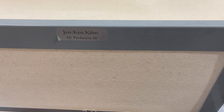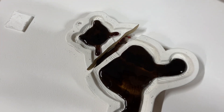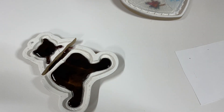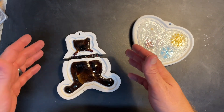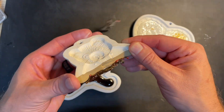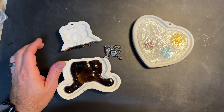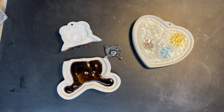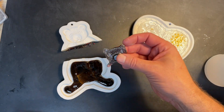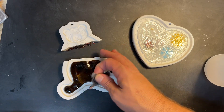These are finally cool enough and I have something to show you. I had peeked already so I knew what happened — looks like I had a break. It also looks like there's generally not enough glass in either one. Let me carry the pieces over to my workbench. I have a feeling this break has more to do with my firing schedule than anything else. I fired at a fairly aggressive ramp up — 400 degrees per hour — and I even thought as I closed the kiln that that was rather aggressive.